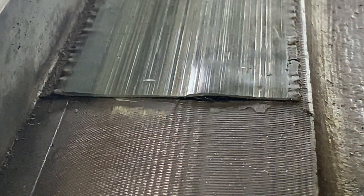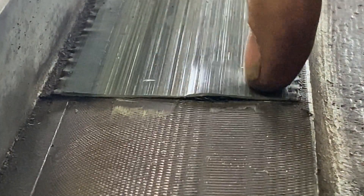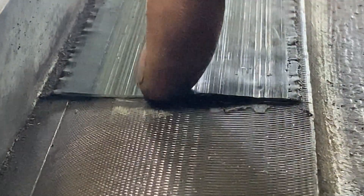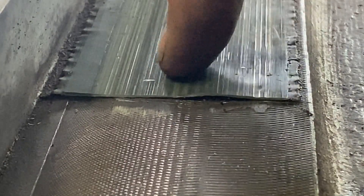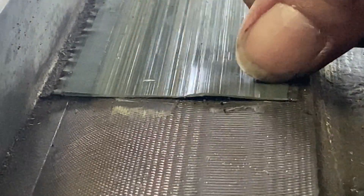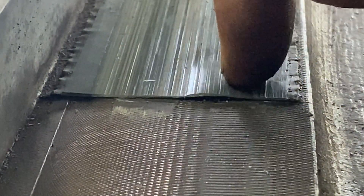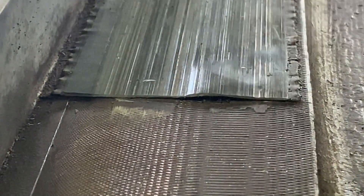Sorry, I got a phone call and since I'm filming with the iPhone, the video just cut off. There is still a bit of a bubble here — this is the longest one and I'm at 31 inches here. But there's still a bit of a bubble and I'm thinking maybe I'd be better off cutting it all the way to where the turcite is nicely glued to the metal, so that oil doesn't seep in and worsen. I'm not sure — let me know what you think.